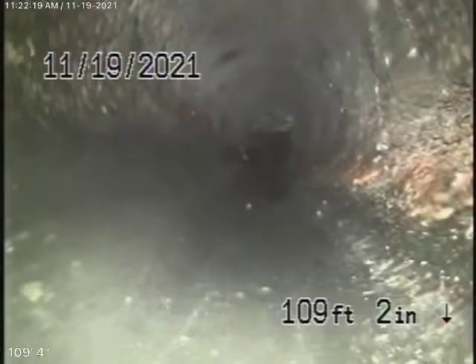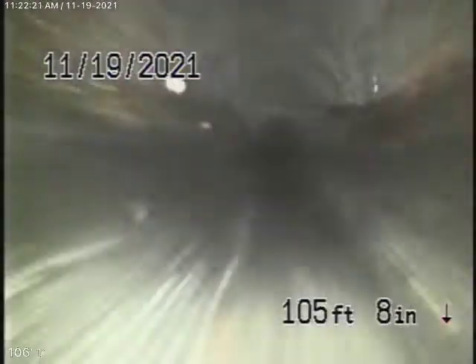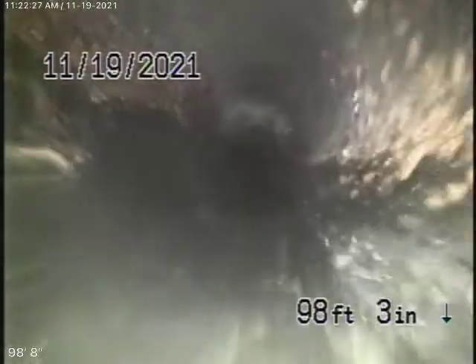There are a little bit of roots in the connection over there, nothing serious, as it comes back right away to an ABS plastic pipe. Bringing back over here, it's all ABS plastic and it's all in good condition. Just bear in mind that this sewer line has a very good grade going downhill. That little bit of roots at the end of the line is really not going to be a problem at this time, and with the good grade of the line, it really shouldn't be a problem. You may need some periodic cleaning at some stage, but as of today, those roots were very minor.